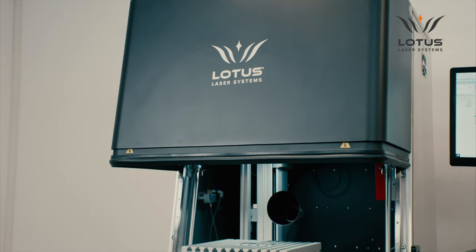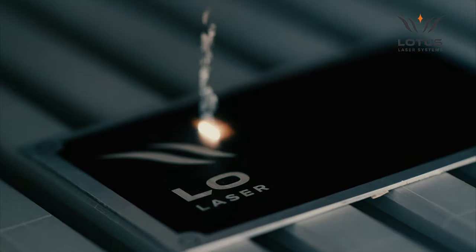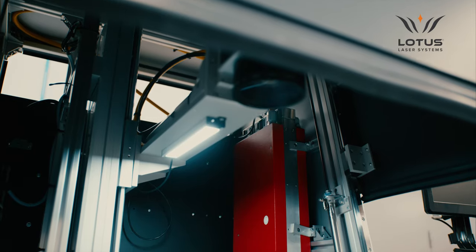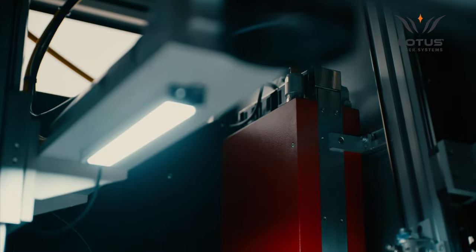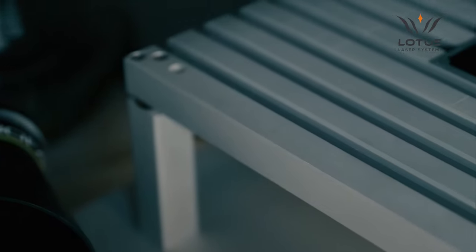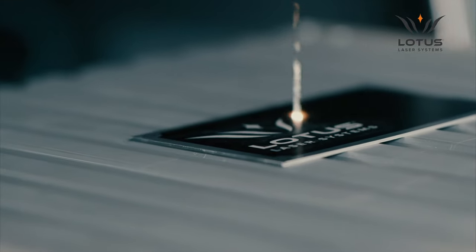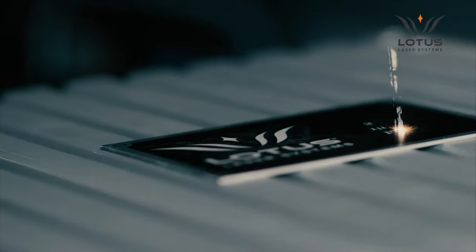Built around an extruded aluminium frame of incredible strength, META-C is designed for heavy commercial or industrial levels of use. META-C can incorporate one of the widest range of laser source options from a number of world-class technology providers, and is available with 1 micron Q-switched and MOPA fibre lasers, 10.6 micron CW CO2 lasers, or 355 nanometre UV lasers to cover most laser marking or laser engraving applications.